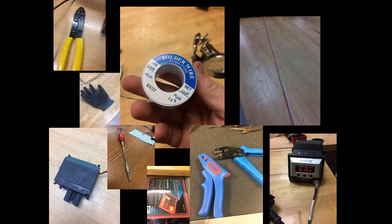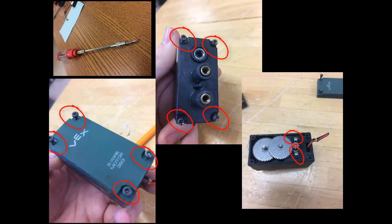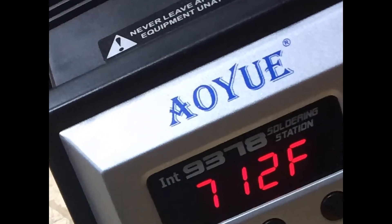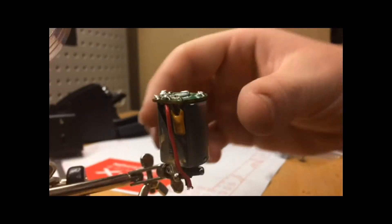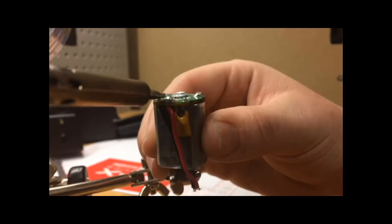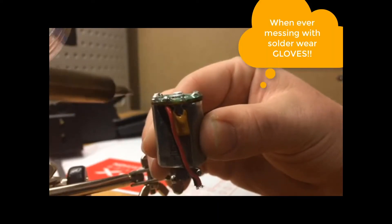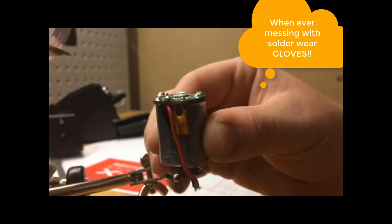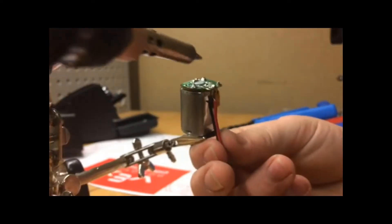The other materials you're going to need are wire strippers, crimpers, heat shrink, a glove, soldering wire, wire, a soldering iron, and a screwdriver. Take the screwdriver and remove the 10 screws. Now that you have the actual motor inside out of the casing of the VEX motor, you're going to need to heat up your soldering iron to 712°F, because the factory solder has a higher melting point than the solder we'll be using later. Keep touching the solder to the melted solder until it melts so you can slip out the old wire.